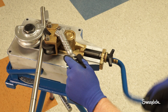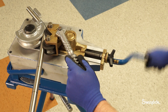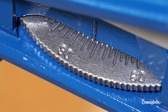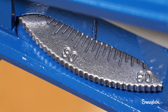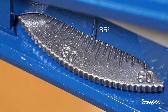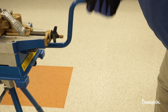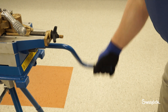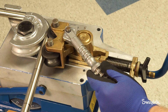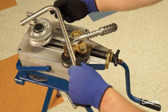Rotate the hand crank until the bend wheel displays five degrees less than the desired bend angle. This will prevent setup scrap due to over bending. As an example, for a desired bend angle of 90 degrees, rotate the hand crank until the bend degree wheel reads 85 degrees. Unload the bender by rotating the hand crank in the direction opposite the direction used to bend the tube, while gently pushing the roller bracket lever counterclockwise until the roller swings away from the tube and the tube can be removed from the bender.